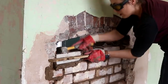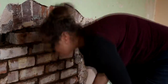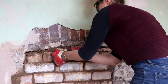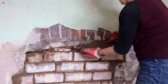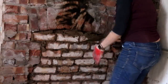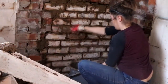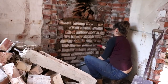I was concerned I'd struggle when I got to the narrow gap at the top, but I was advised just to add mortar as normal and find a slim enough piece of brick, or if I didn't find one, just chip at it and fit it in and add plenty of gobbo. But by the time the whole thing was done, I'd scrape off any of the excess snots and then fill any gaps with mortar while I had it. I didn't want anything to be protruding by the time it's set, which would then make life harder for the plasterer later on.